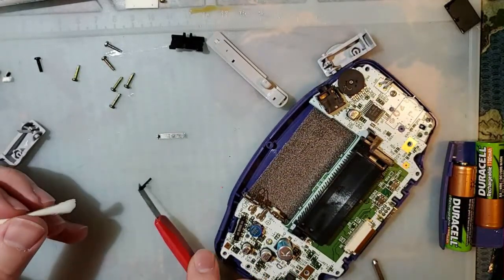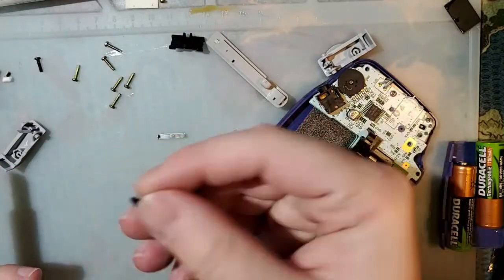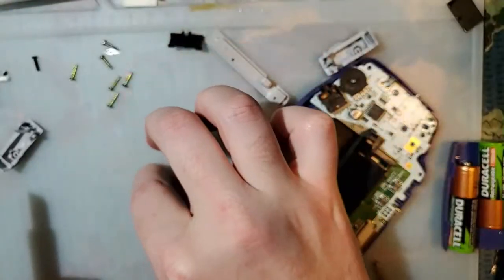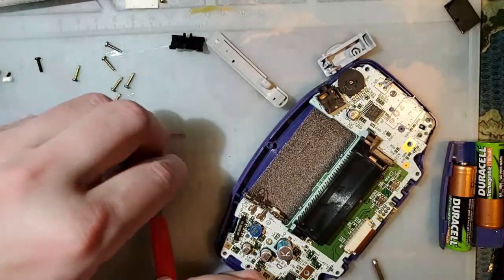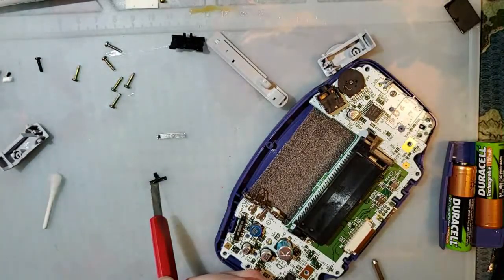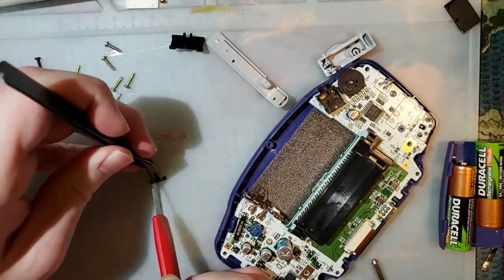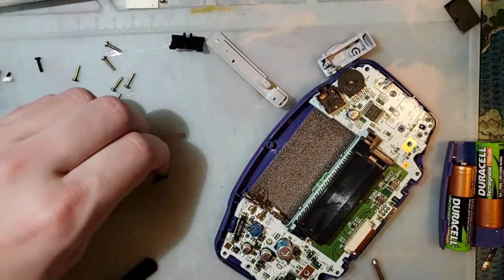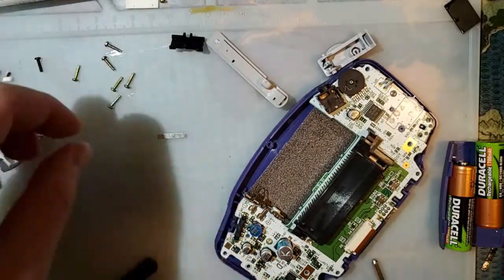I'm going to go ahead and clean up the Switch itself now. There's this little V-shaped wiper inside of there. It's probably really difficult to see. I'm going to try wiping it off, just give it a quick once over. But I'm going to hold it in with my blade here because these things can and will fly off on you. And then I'm just going to give it a little bit of a bend, just in case I accidentally flattened it out when I took it apart. And look at that. We're almost done.